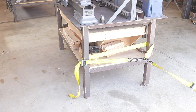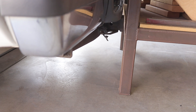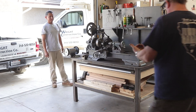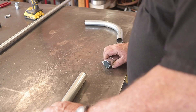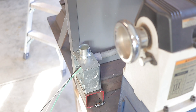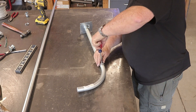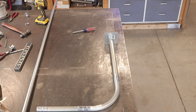That worked pretty effortlessly — so well that I pushed it too far and had to use my truck to push it back a little bit. By that time my worker had come back to the shop and helped me. Between the two of us, I decided I wanted to flip the table around completely — I wanted the metal lathe on the working side of the shop since that's where I use it most. I don't use the wood lathe very often. So it's time to move the electrical around: I'm using one-inch EMT and a bigger box for the 220 outlet. I had to do some creative routing to get around my garage door, creating a little bend to tuck in behind there.